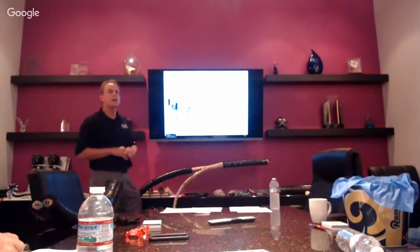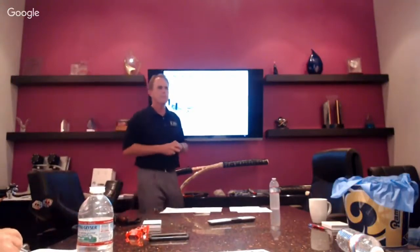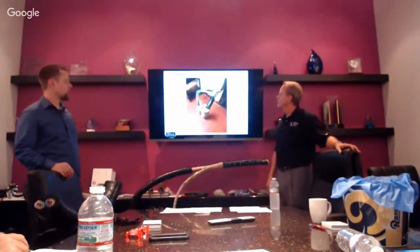So now, any questions on conduits, the runs? What's the most you can cut the 24-inch radius, like half the amount? It doesn't matter, really, just whatever fits the job, as long as we have the radius. There may need to be some discussion at the time, depending on the situation. Come down here. I'm just thinking, like with the peekaboo, you're right up against the stud right there. You cut it pretty shallow, you're not gonna have much in your bend. Can you back up to the one where they missed the curve? So there is a limit.